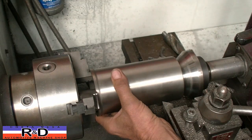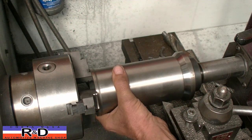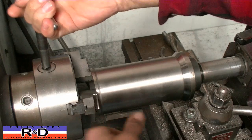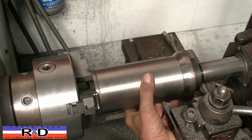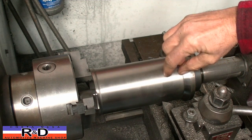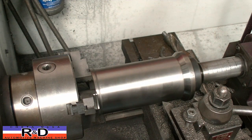If we try to put this in the engine, the sleeves would run into each other, so I'm going to knock the diameter down. When you set this up, you just rotate the sleeve around a little bit and bring the center up. Remember, you're going backwards on your chuck to tighten this up — doesn't have to be terribly tight. Bring this back out a little bit and check it. I just want to put this in so that it supports the sleeve. If you put it in any tighter, when the sleeve separates, you have the possibility of the piece jamming and jumping towards the sleeve, creating havoc on the bottom of the sleeve.